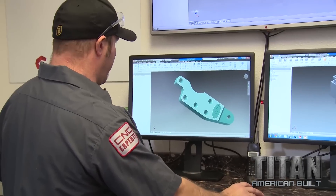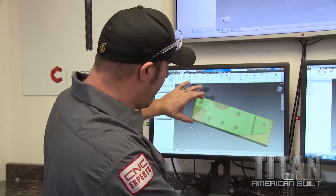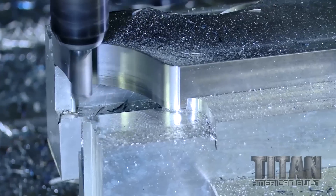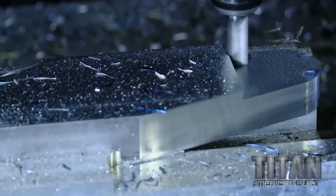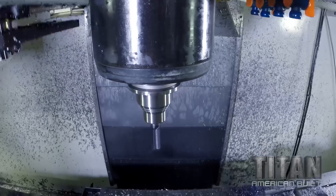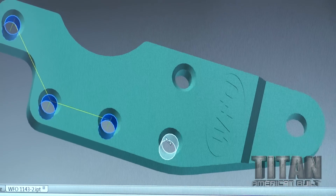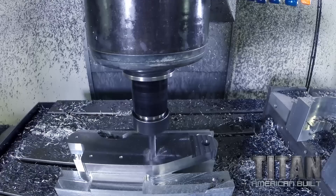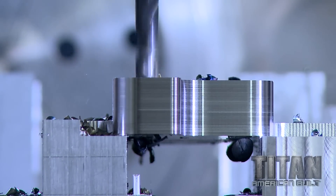We're using Autodesk to start programming. I'll start with a three-inch face mill to face the top and make it look nice — we're not cutting anything on the profile, just getting rid of excess material. I'm setting the speeds and feeds, running it aggressive, and leaving a little material so we can take a finish pass and make the part look beautiful. Then I'll drill all the holes — I selected them all, told the software where the drill is, how deep to drill, and there it is: the drill went all the way through the part.